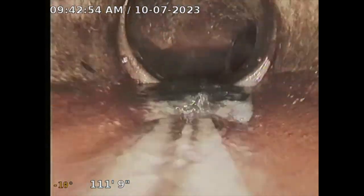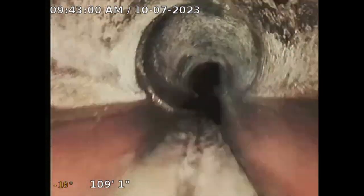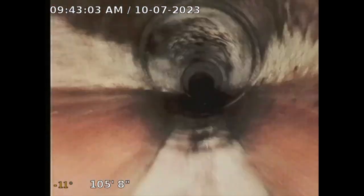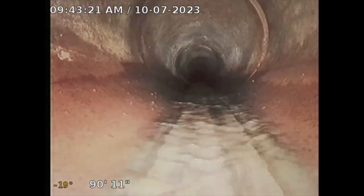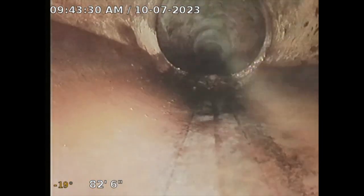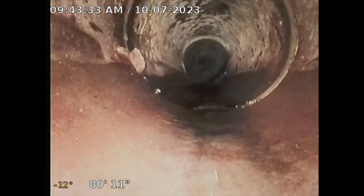A little minor offset, but everything looks good. I don't see any issues. It's not perfect, but there are no issues or concerns at this moment. Now I'm just going to back this camera out and record the whole thing as I'm coming back. It looks good. It's clay pipe — clay is good pipe. Some people hear clay and it's all doom and gloom, but it's not — it's good pipe, it lasts a long time. The only issue is those clay joints can get damaged, but these look good. There are a few joints that do have a little bit of minor tree root or grime buildup, but it doesn't seem like an issue — it's not going to cause blockage.